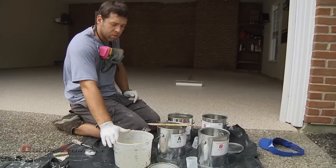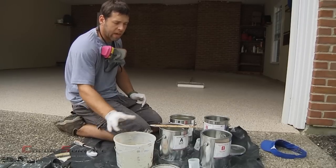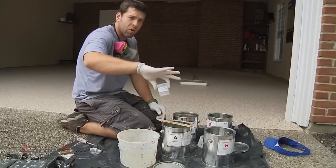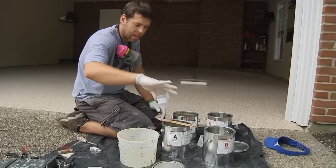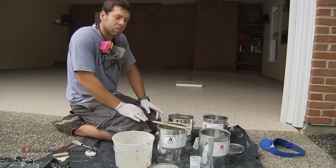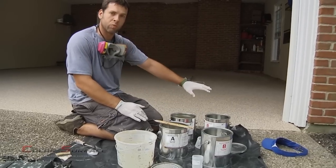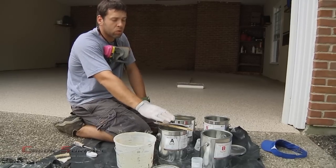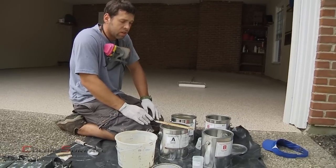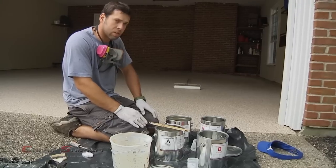Now we're back. It's day two. We have blown out all the loose flakes and cleaned those up, so now we're ready to apply our topcoat. What we have is a two-component polyurethane. You've got a part A and a part B. It also has a UV-resistant additive that is added to the part A. That way, the topcoat won't yellow or discolor from sunlight rays, especially since we're coating out beyond where the garage door comes down and it will be exposed. This polyurethane topcoat will protect the floor from staining — chemicals, gas, oil — stuff gets on the floor, you can clean it right off. And it will give it a nice shine and protect the floor for a lot of years.